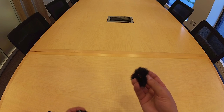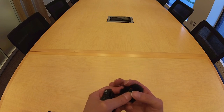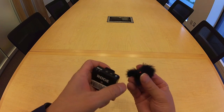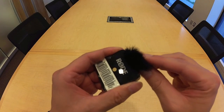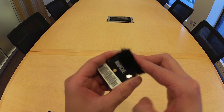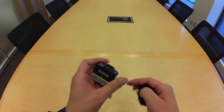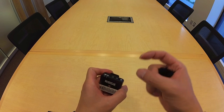The kit includes a fur windshield for use with the transmitter in noisy or windy environments. It's a bit tricky — just pull back the fur windshield. You'll notice two pegs surrounding the built-in mic and two notches. Insert one peg firmly, then push the other side of the fur windshield so its peg goes into the other notch. Press firmly. It is precarious, so I would recommend maybe just getting the standalone lav mic that the lab has to loan, as it includes a wind socket.